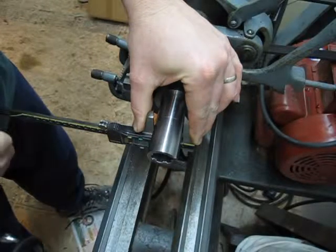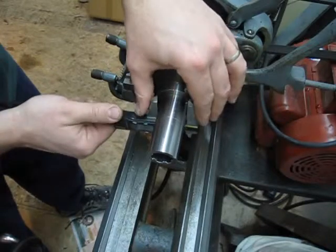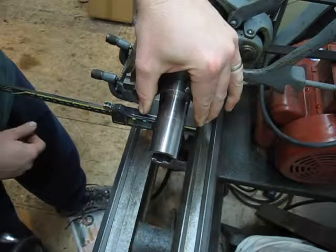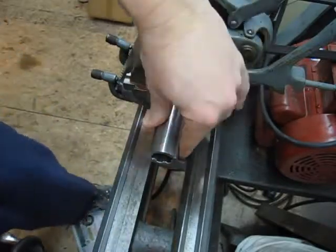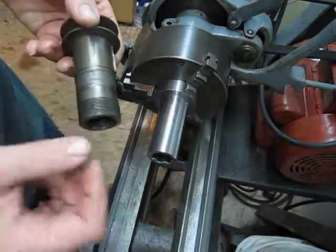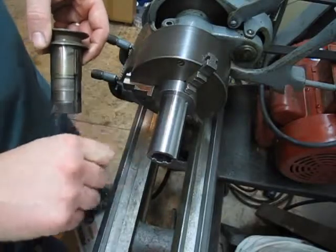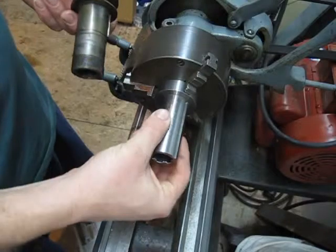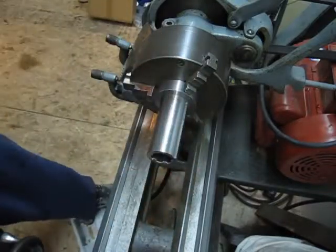So inch 3790, inch 39. Yeah, it's about 20 thou. It feels a little bit less actually on this part, probably due to wear. But anyways, I made this to fit the bearings, and I made this to fit that. So I've got a little bit more of a step here. But anyway, regardless, there's where I'm at.